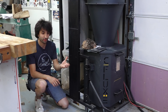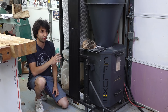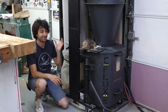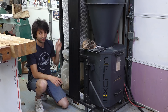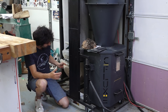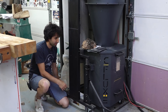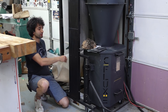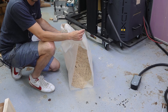As far as overall separation goes, the big particles don't make it to the filter anymore, but the fines still do. A lot of fine dust does make it into the filter, and the filter does need to be cleaned fairly often. If you're like me and came from a bag unit where you always have to beat the filter, this really isn't all that bad — you just come over and hit the little paddles. But there is a significant amount of dust that ends up in the actual collection bag. I filled this drum about five times, and this is how much stuff ends up in the filter from just what I've been able to dislodge — a pretty good amount of fine dust in this bag.